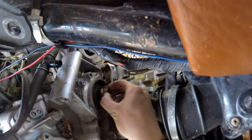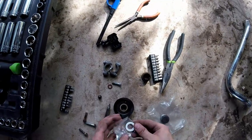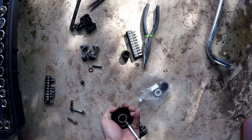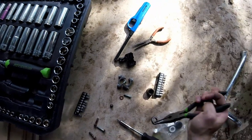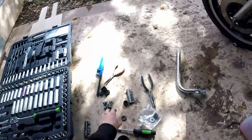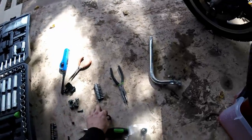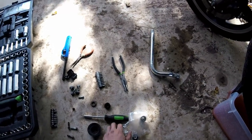I'm going to have to get that out of the back of that impeller somehow. And wow, that just came right out. That is my old mechanical seal. As you can see, the design of the new one is slightly different — it's a much larger sealing surface. This is just rubber around here, so I should be able to dig underneath the mint. Yeah, you can see it's just really brittle, just cracking apart. There we go — that is the old Polo Mint out. I'll try to clean up in that cup where this new seal is going to have to stick to. I'm going to heat that up and put it in there once I get that cleaned out with some Q-tips, to get as nice a sealing surface for that new Polo Mint as humanly possible.